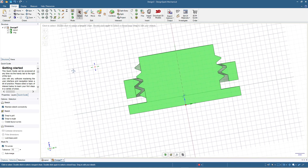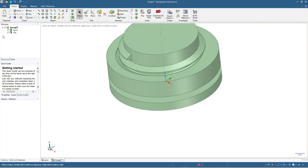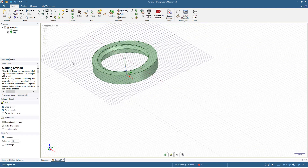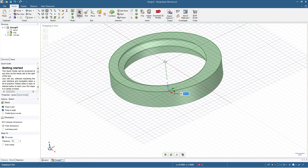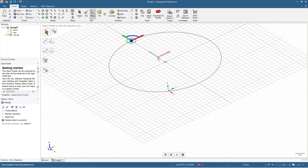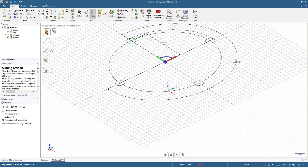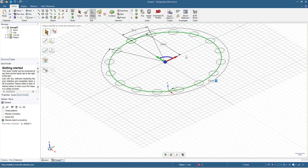Next I will add more design to the ring to make it easier to tighten. We'll add some contour for the outside of the ring. I'll hide the spout, click on the ring, then click circle to make a basic circle shape for the cutting design — adding a circle by 2 millimeters in diameter. I'll hide the ring and copy this circle design: click here, press move, move this center to the center, then click create patterns. You'll see the circle copies several times. Input 16 in the count column.